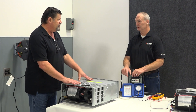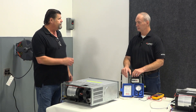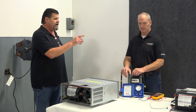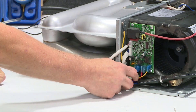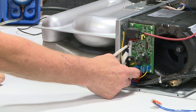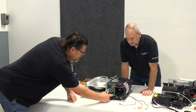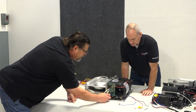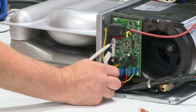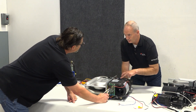At that point we know we have to pull the furnace out. Once you get the furnace out, you take the top case off — just like what we've got shown down here — and now you have access to everything. You've got a red and black wire coming in, and then the other red and black wires go directly to the blower motor. The question is: with the thermostat jumped out and power applied, do you have power between the red and the black — meaning are you getting power out of the board to the blower?